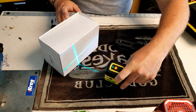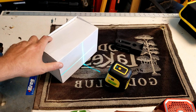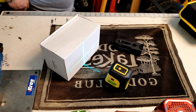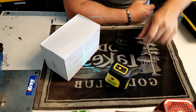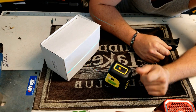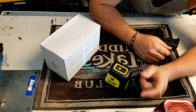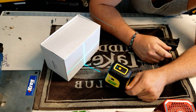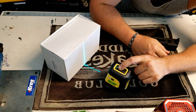So let's see if we can see that. You see the target there. So this laser is set to on — that's all I've done. I've not hit anything with the button on top. Now the button on top will change it to your plumb line. You tap it again and now you have your level horizontal line, and then you also have your cross level. So now you have your center point and you can rotate back through them.